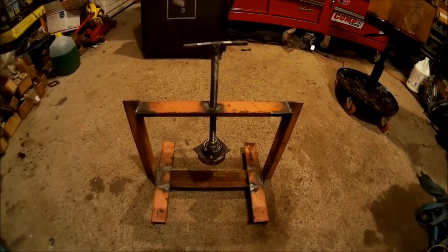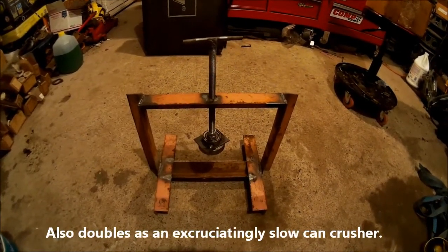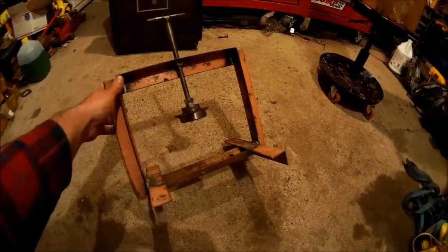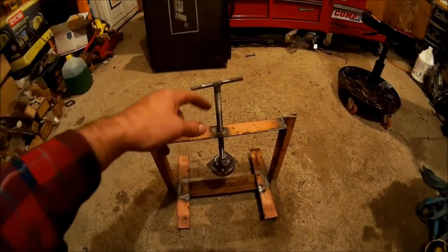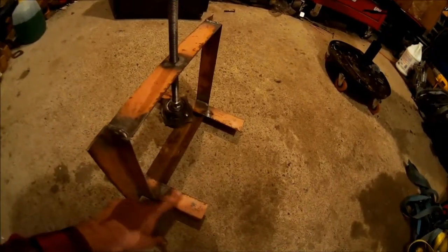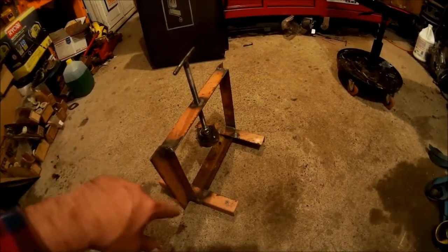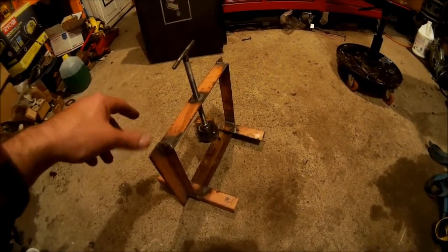That's where this contraption comes in — this is my homemade spring rate tester. Basically you've got a frame here made out of some scrap angle iron, and you've got a threaded screw at the center that you use to compress your spring. On the bottom, these legs are basically for supporting the scale that we're going to put in there. You're boxing in a little press frame to counteract the spring pressure that you're compressing with.